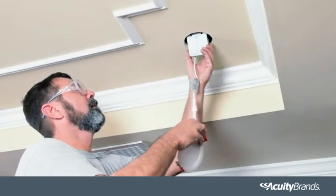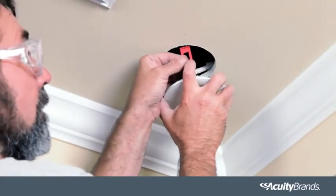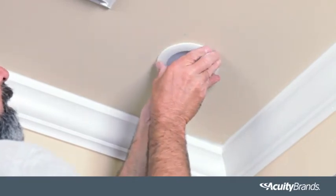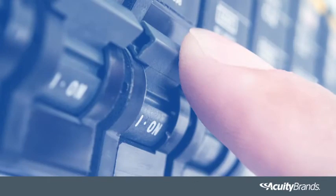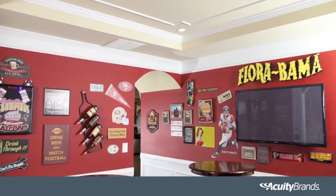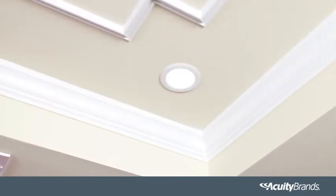Place the remote driver box through the cutout hole and lay it on the ceiling. Pull the spring clips on the fixture up and through the cutout hole. Place the module in the hole making sure the spring clips are holding securely. Turn on the electricity at the circuit breaker box and walk back into the room where the fixture is installed. Turn the power in the room back on and be sure the module illuminates.